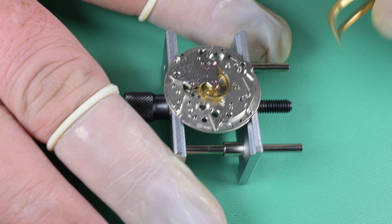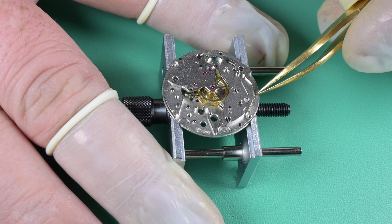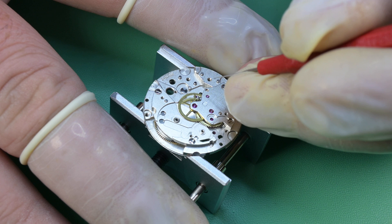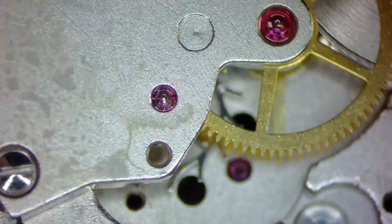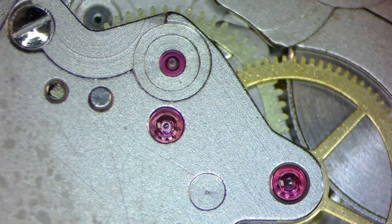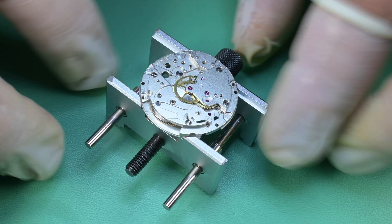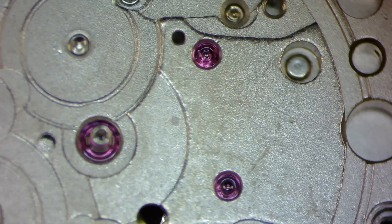After all that we can install our click spring — I really like this design. It just sits flat, which is great. We put on the ratchet wheel, making sure the square cut hole aligns with the barrel arbor, then use my hold-down tool to hold the ratchet wheel still while torquing the screw. Next is the crown wheel — putting a little HP 1300 there. We then install the bushing, which was a really tight fit — I use my tweezers to press it down and make sure it's flush. Then a dab more HP 1300 on the outside of that bushing before installing the crown wheel. The crown wheel didn't want to sit all the way down because the click spring was slightly in the way, so I pull that click spring out just a tiny bit and then it seats fully.